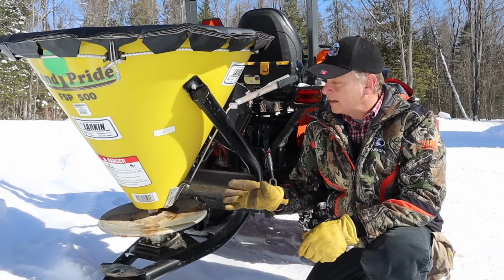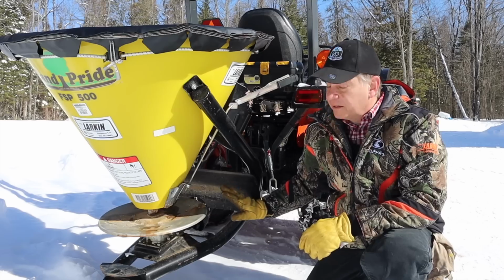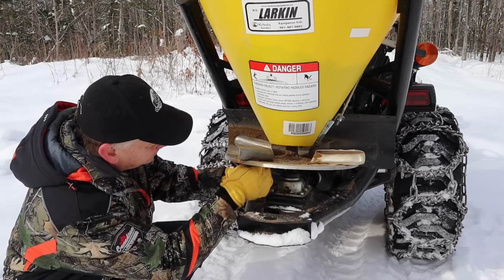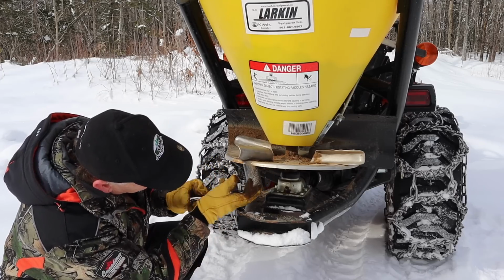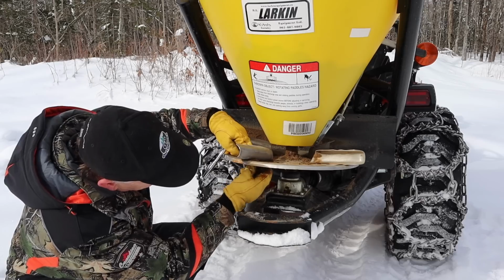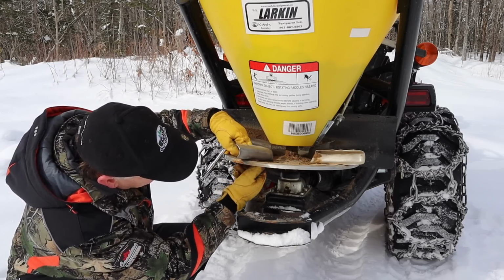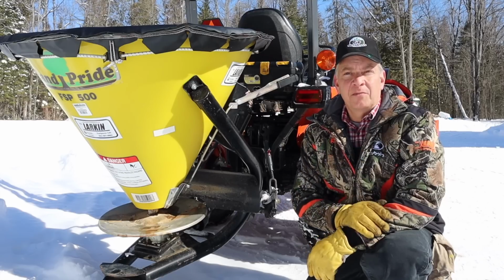Although in the past I'd had a number of really good suggestions from a few subscribers about possibly welding in some deflector plates, I had a really simple suggestion. I removed the distribution vanes off of the spinner plate. And now at full throttle, sand or the material will come out of the hopper, hit the plate and spin, and it'll only go about 5 or 6 feet, which is perfect for my driveway.